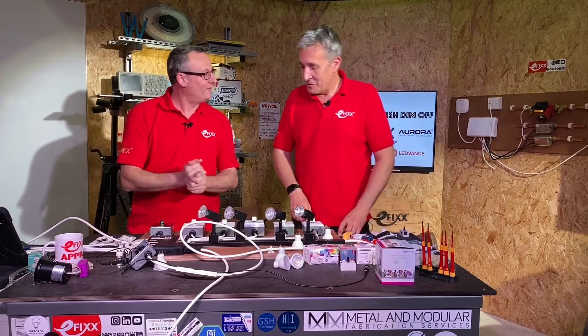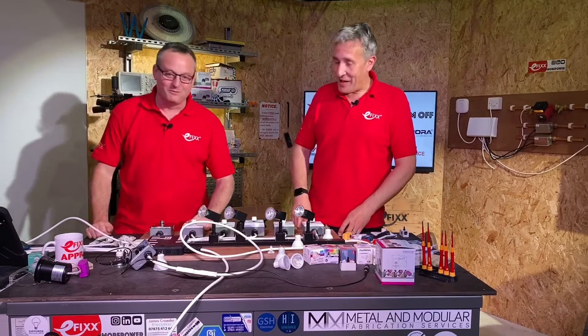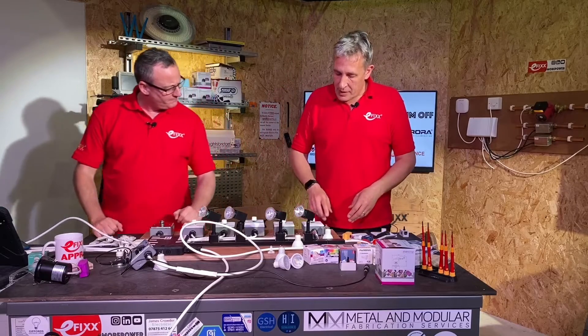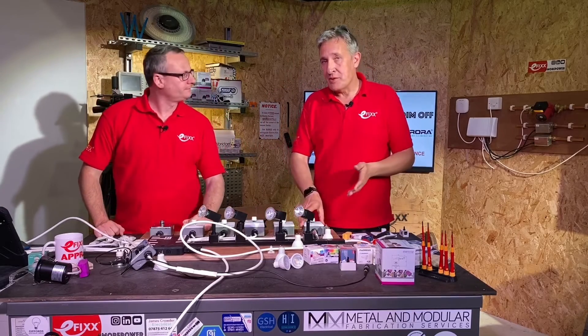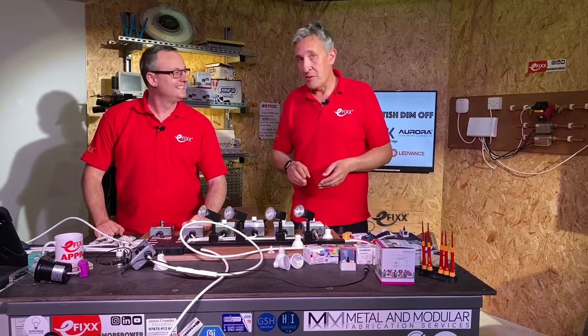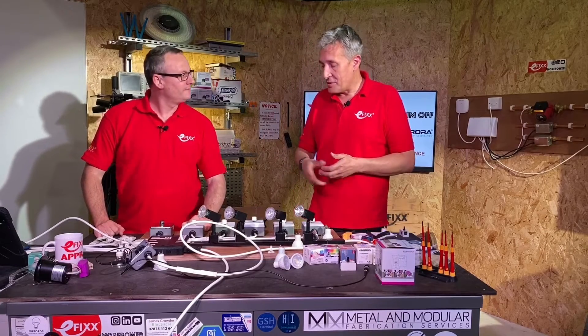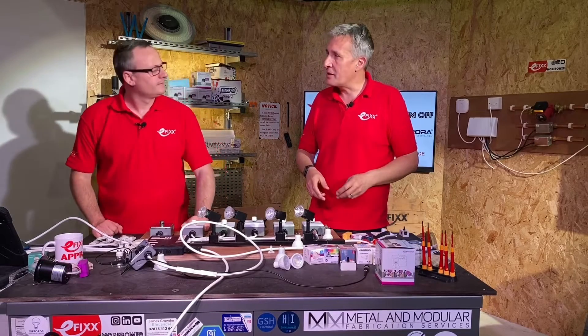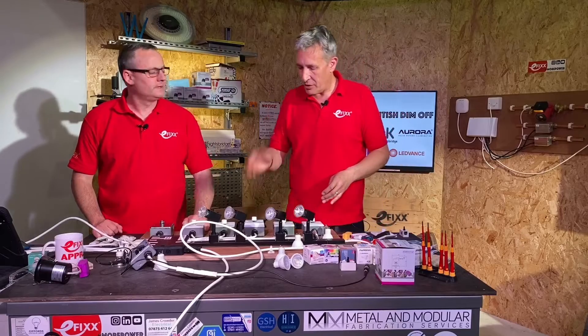Don't lose those instructions — we've felt that pain. So that's one way of doing it: the twist-flash method, remember the combinations. There is a simpler way on some dimmers, and that's to remove the switch plate — there's normally a little potentiometer on the back that you can set.